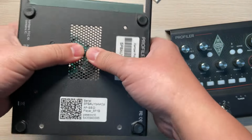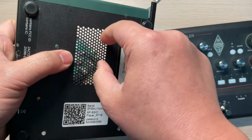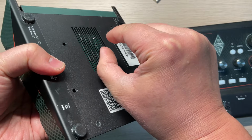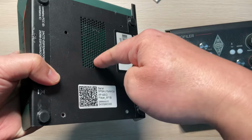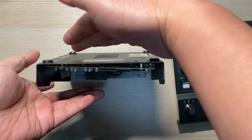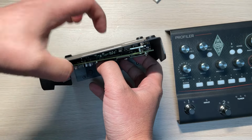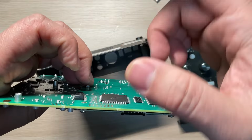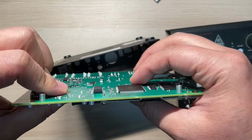And you can see here, because they want good heat dissipation, the problem is that the board actually has like a 2 millimeter gap from the case. So if you have a very strong crush or heat or something like that, it can temporarily bend, because you can see this is already bent this way. Forgive my poor English. So it hits the board and the board bends just for a second or maybe even a very short time, and just at that time some soldering point gets crushed and it looks normal, but actually it's not in contact anymore. So that's the problem, I guess.